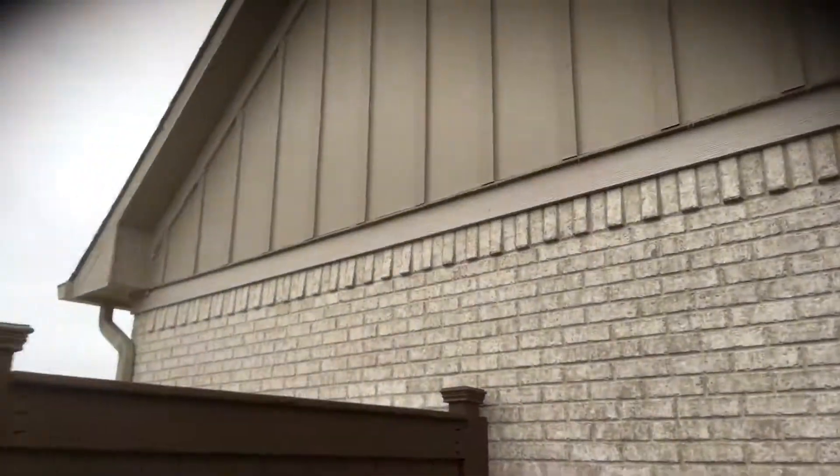This wood drip edge along the side there is something that's going to need to have an eye kept on it. Moisture, you can tell, is already being absorbed up there. By painting it you're protecting it, but moving forward you just need to be vigilant about painting it every probably seven or eight years, because it will fail.